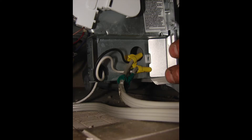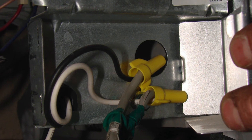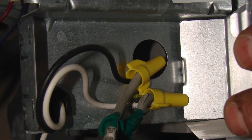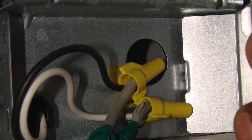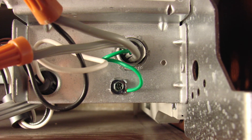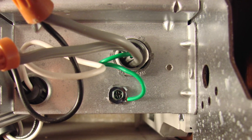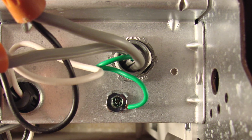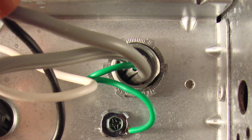With this mistake, we're looking at a junction box for a power cord and appliance cord to serve power to a dishwasher. The appliance cord does not come through the half-inch knockout that's been provided, so the connection is not legal, not proper, not secure — and there's no ground wire attached. The solution is to bring your appliance cord in through the provided half-inch knockout opening, put an approved cord connector on it, and make up your ground wire to the green ground screw that will ground the equipment.